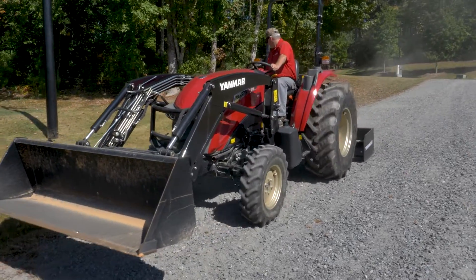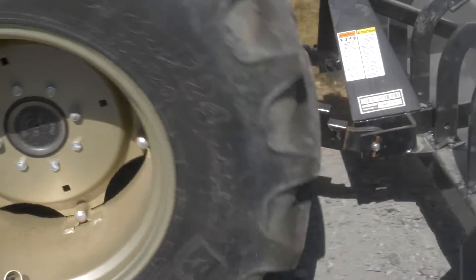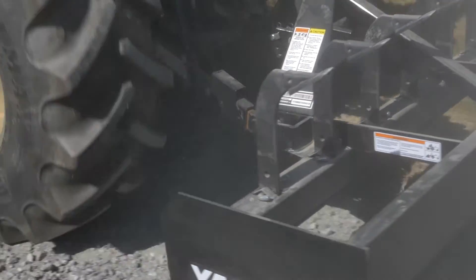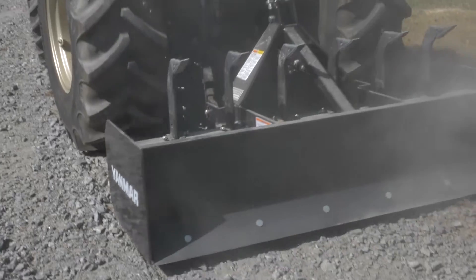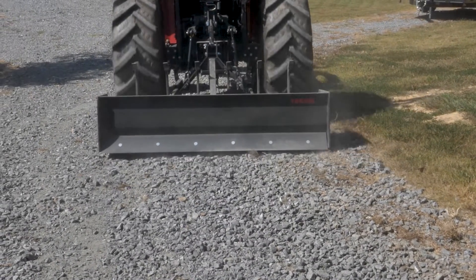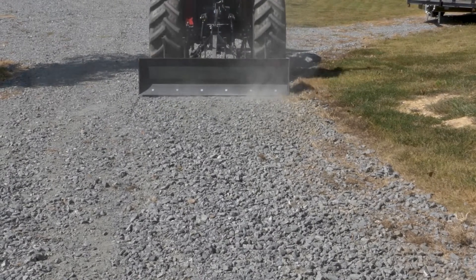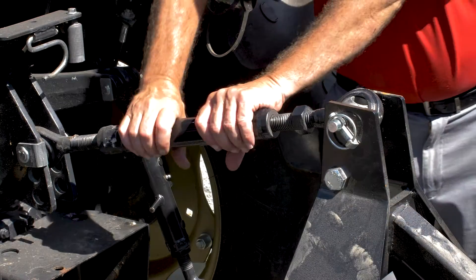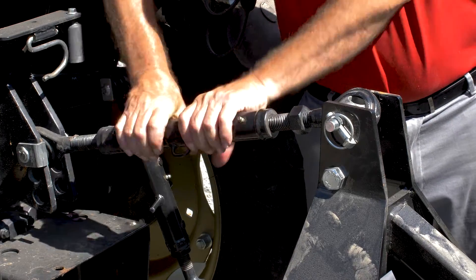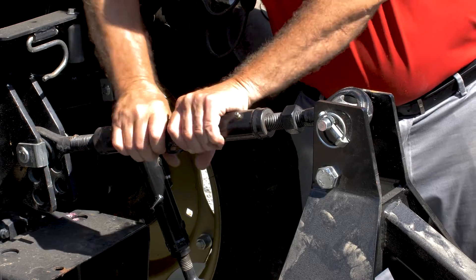Scraping is performed in a similar manner to leveling. The blade side-to-side level may be slightly canted to provide a small grade or crown when working a gravel road. Material that has been worked may need to be compacted. Usually a few passes with the tractor tires will do the job. Remember, proper top-link adjustment will fill the box easily and material can be carried to the desired location.